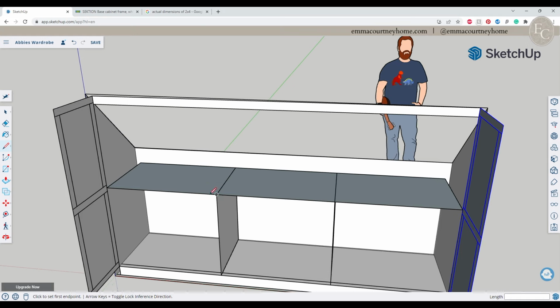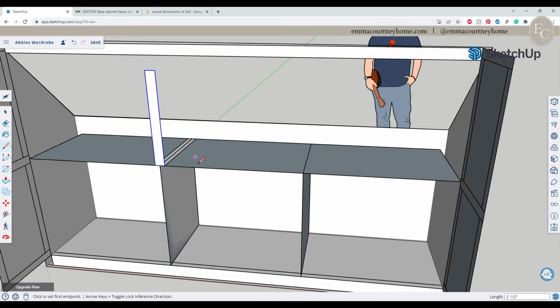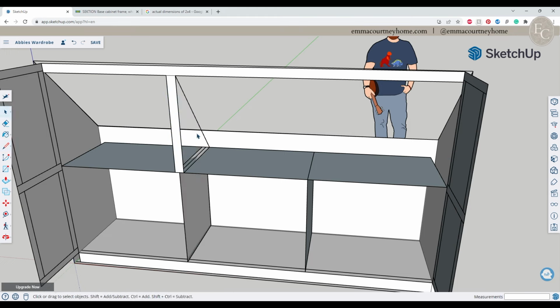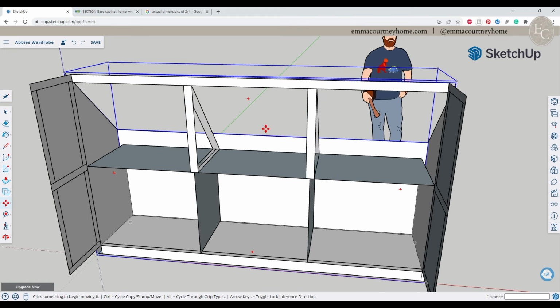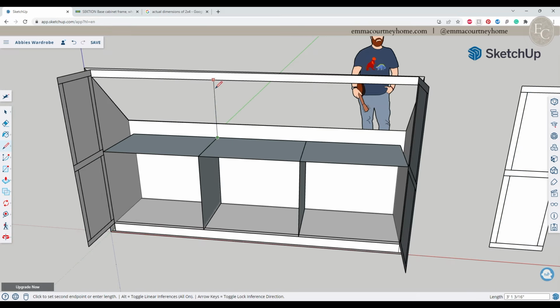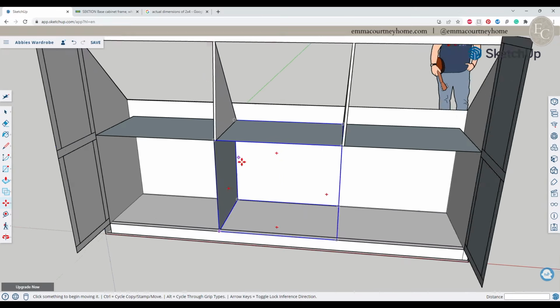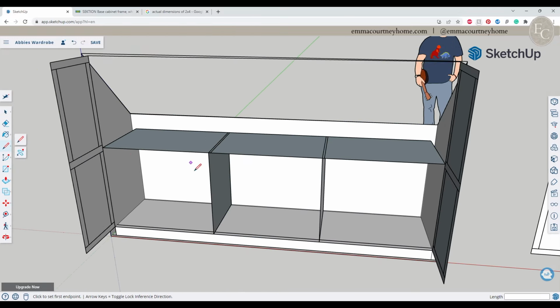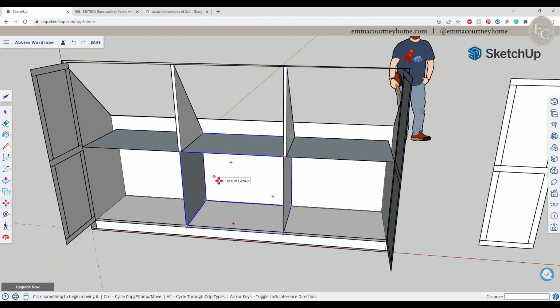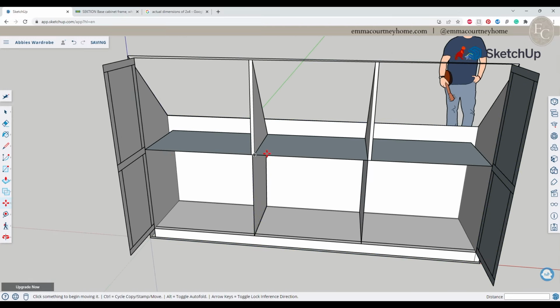At this point, we knew that at least two hinges could go in the base cabinets. And then I was trying to figure out what I could do to provide enough structure for those upper hinges. And I think here I'm trying to draw some sort of 2x4 structure, because the thickness of the sides of the lower cabinets was exactly the same width as a 2x4, providing enough structure for it.